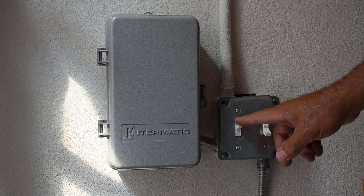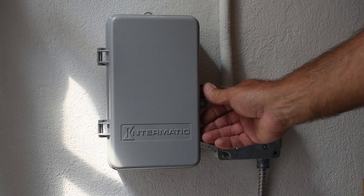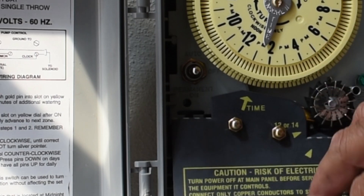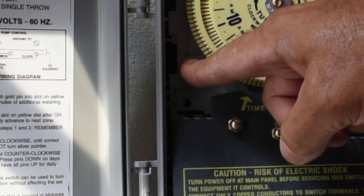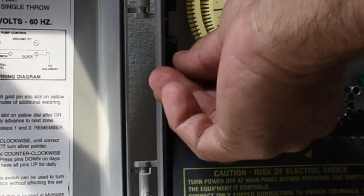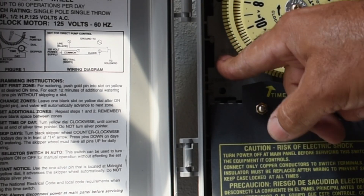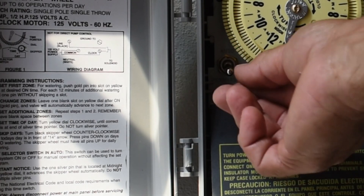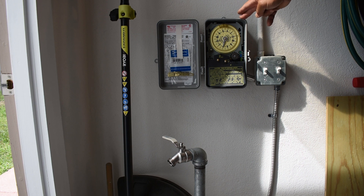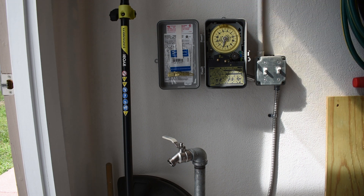Roll back together — I got my light, good. Now when I turn the switch to manual, the relay should click if it's wired properly. Yep, you can hear how loud that is. Now if I put this to on, when I turn that on the pump should come on. If you do as I showed in this video, you should have no issues at all using one of these 120 volt mechanical sprinkler timers. Thanks for watching.